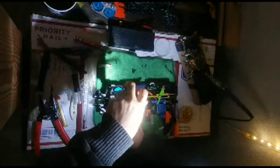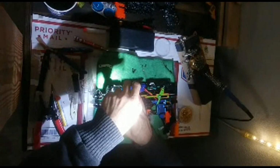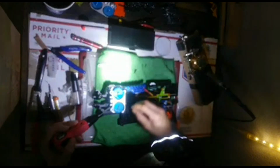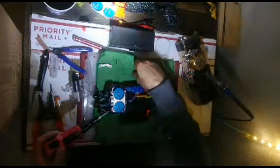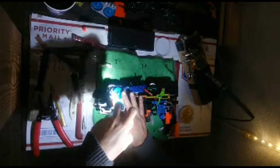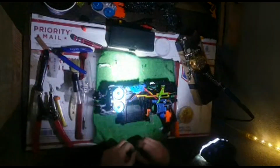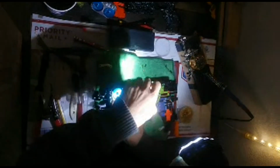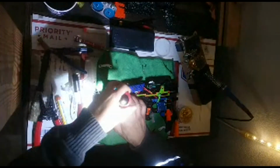So when I go in with these guys, I'm just gonna start them very gently, otherwise they'll cross thread and strip and blow the threads like we talked about. I'm just gonna set them and give them a few initial turns to get them in there. And then once I know that they've actually fallen into the groove, then I'll go ahead and zap them with the electrical screwdriver. But really, as much help as the electrical screwdriver is in cutting labor time, it's like a katana sword. You got to be careful with it, otherwise you'll blow through your work, and it'll slice and dice up your work to the point where you can't recover from it.